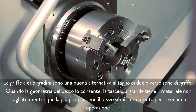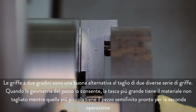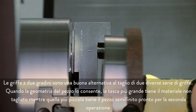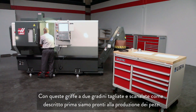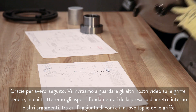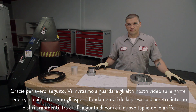Two-step jaws are a good alternative to cutting two different jaw sets. When part geometry is favorable, the larger pocket holds the uncut raw stock while the smaller pocket holds the half-finished part for the second operation. With these two-step jaws cut and grooved, we are ready to start making parts. Thank you for watching. Be sure to check out our other soft jaw videos where we cover the essentials of ID gripping and other topics including adding tapers and re-cutting your jaws.